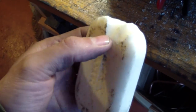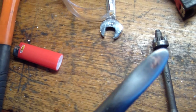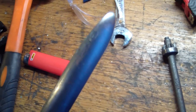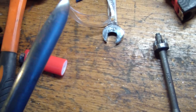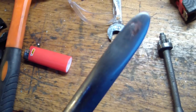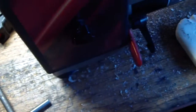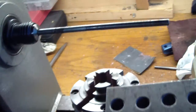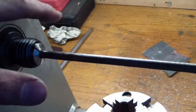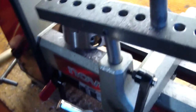I also stopped using paste wax and I'm just using a bar of Castile soap — it works a lot better. It's a good lubricant, doesn't stink like the paste wax, and doesn't burn like the paste wax does either. As long as you keep that copper well lubricated, you don't get nearly as much copper impregnating into the tool steel. This needs to be polished better and probably heat treated, but keep it lubricated and everything works a lot better. Anneal it when necessary with the torch — anyway, that's enough for now. Thanks for watching.